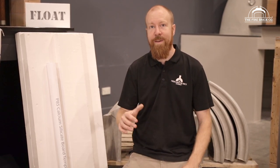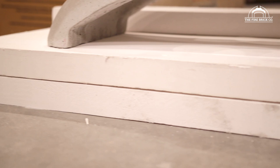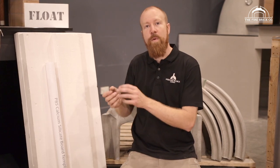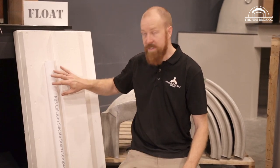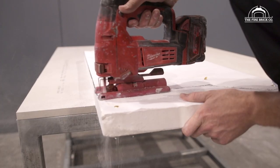The very first thing you'll be doing, if you've already built your stand, is putting down a layer of calcium silicate board. This material is a high temperature insulation board with a very high compressive strength, and this is what we're going to be sitting the entire oven on top of, to prevent the heat in the oven from being drawn through the floor and into your stand. You'll be using paper templates to cut out this board, pinning the paper templates onto the board with the thumbtacks that are provided.